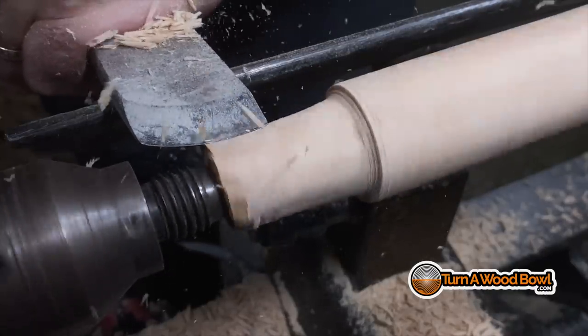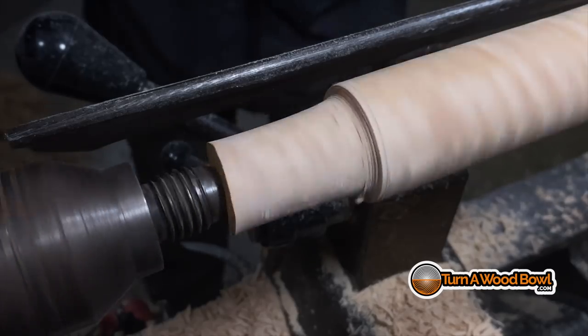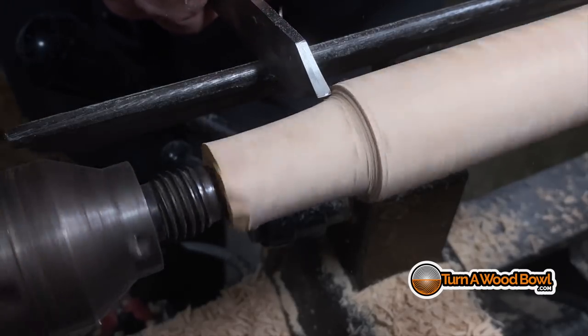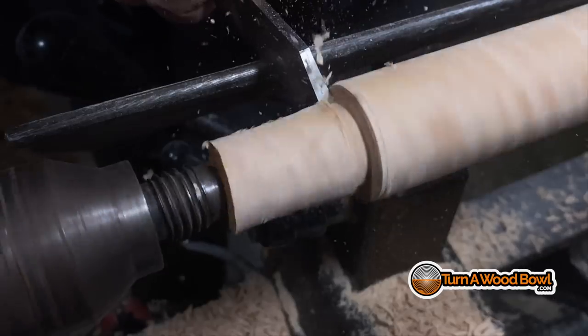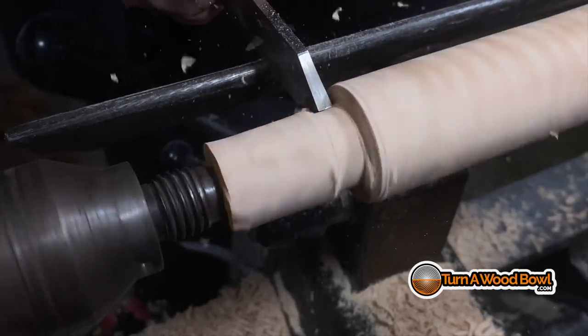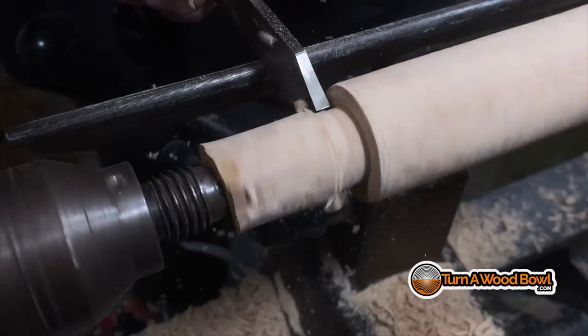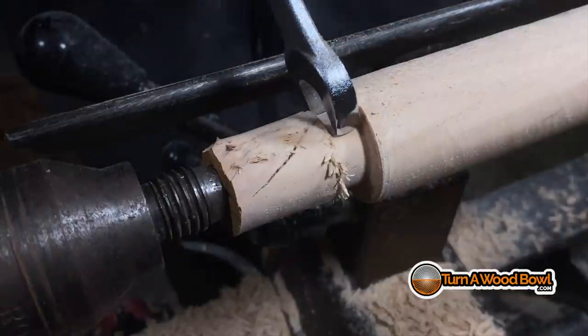...which we go over in my Treatable Understanding Green Wood e-course, now available online — wood takes about a year to dry per inch of thickness. So after five years this should be dry. When we say dry we actually mean equalized — wood is never truly dry, but it's relatively free of moisture at this point, and hard as a rock.